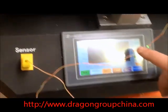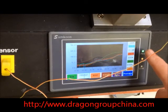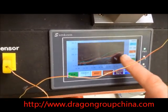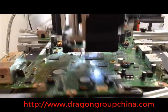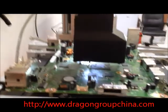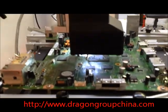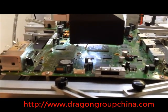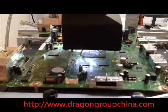You can see that with the green line as it goes up, and then it'll just sort of flatten out, which is towards the end of the profile. So it's on the soak stage now — it's on a preheat, gone on to stage 3, which will take it to 170, where you can see the red line just sort of goes flat. Obviously some of these profiles will take a little bit of fine-tuning. They're just basic profiles that I've put into the machine. The beauty of this machine is it's totally adjustable and customizable. This profile I've set — I think I've probably left the soak stage for a little bit too long. Maybe five, ten seconds off that. And then you can see your results just by looking at the curves on the graph.